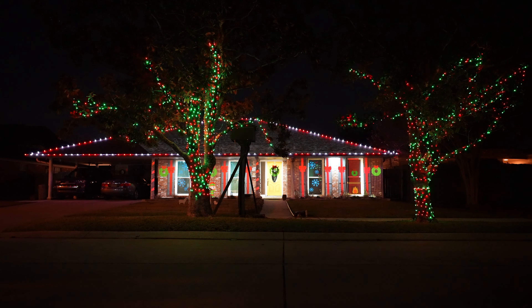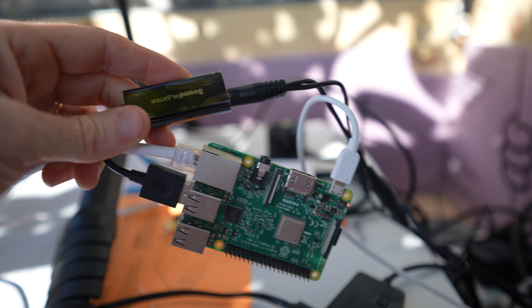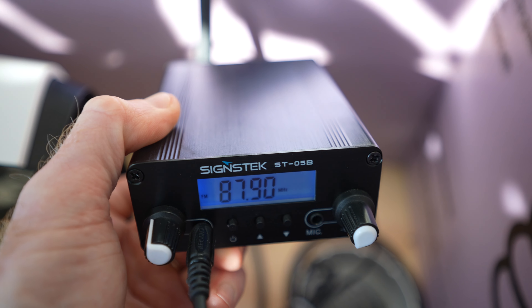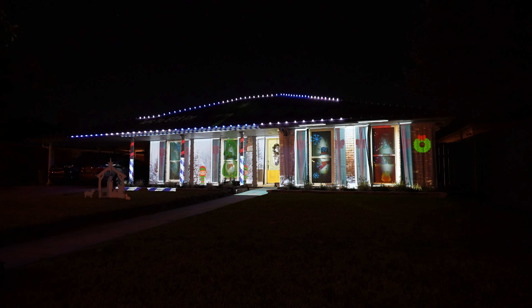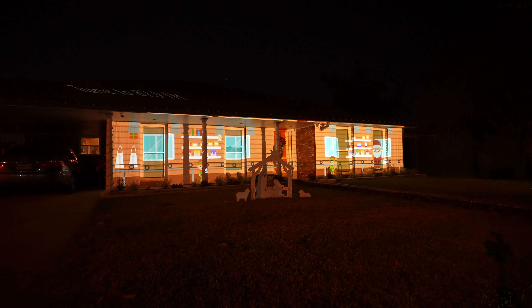One Raspberry Pi is the master and two are remotes. One remote is running the pixels, one is running the audio, and the other is feeding the video source to the projector. The reason you want your master running the audio is because the master sends sync packets to the remotes, and you don't want the audio jumping around to stay synced because you'll audibly hear those jumps. The video can be done by a remote because you can't see with your eye the little jumping the video does to stay synced. I'm barely scratching the surface of what Falcon Pi Player can do — essentially I just have some light sequences and video files running on a schedule that loops the video.